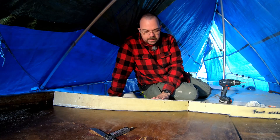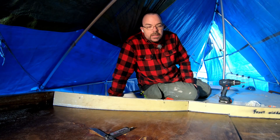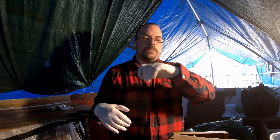The idea is to come a little bit from the outside, go over here, and down in here — all on these open surfaces — to make sure that everything is glassed in well so there can't be any problem with water intrusions in the future. It's Friday afternoon and I've just been up here doing some work. Unfortunately my camera screwed up, so I'll just show you how it looks right now. I've sanded down all the surfaces close to where pieces meet at 90 degrees, and mixed up some thickened epoxy with filler 51, which makes it a great fairing compound.